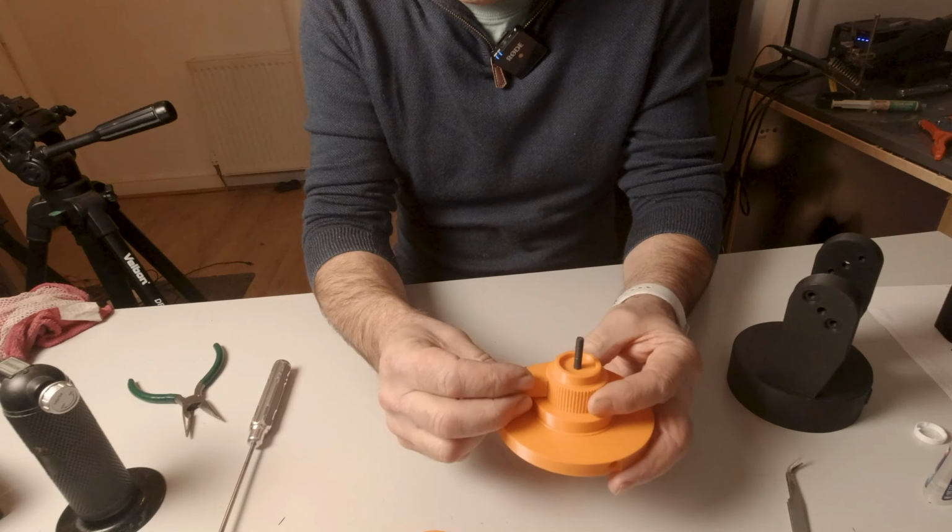Moving on, we're now going to start assembling the hinge part of the fulcrum. Now, probably best to start by finding this knob, part 2360, and you'll also find you need a 100mm long hex head, that style there. There are 2 of these knobs. One is for an M8 bolt, and the other is for the M6 bolt. Now take the M6 one, run it through here. It's 100mm long, and just have that ready for the next step.